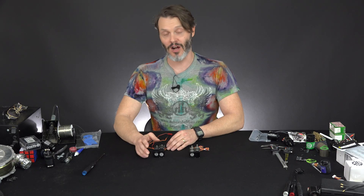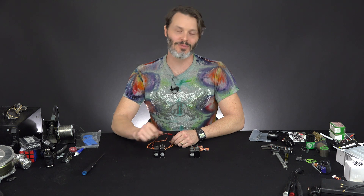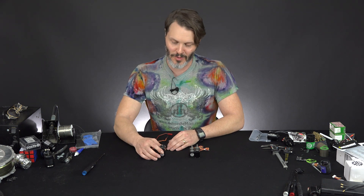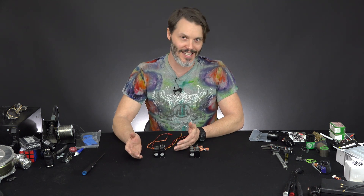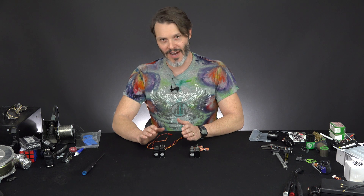Along with that they are blazing fast, extremely fast servos and they also produce a whole lot of torque. On the version 3 we bumped up the torque to about 680-690 ounce inches on 4s, or actually on 14.4 volts on a brand new charged lipo you'll get even more than that. We probably should have called these the SHV700 but I really wanted to be more honest about the ratings, so I called them the 500.